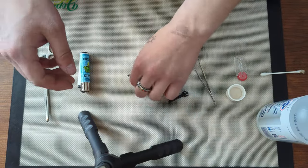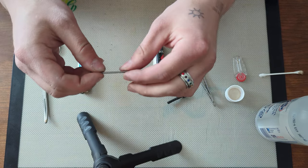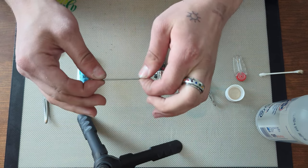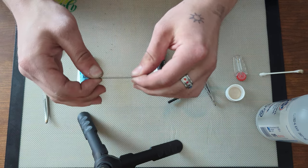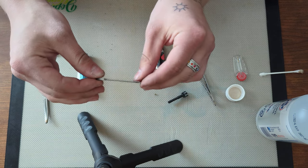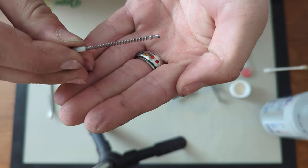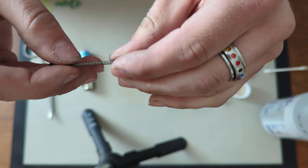Another issue could be a weak spring. Hold just past the bottom threaded portion of the striker and at the top, and just lengthen the spring — pull it a little bit to deform it so it's longer when you're done. You can see where I'm holding it's a lot more compressed on this side. I'm going to pull it out just a little bit more.